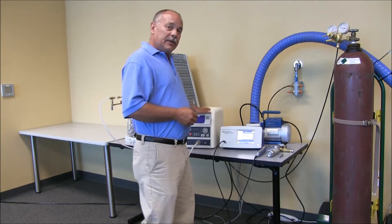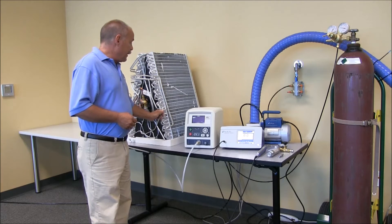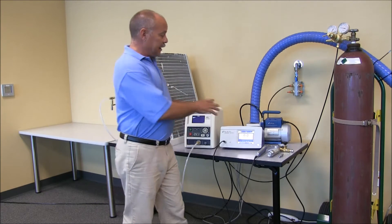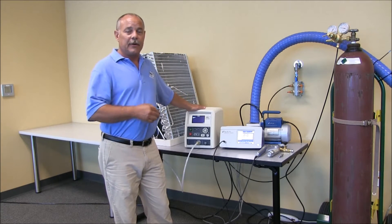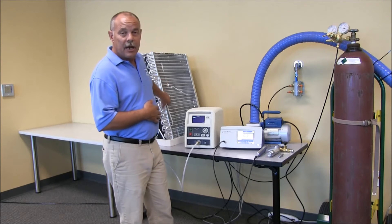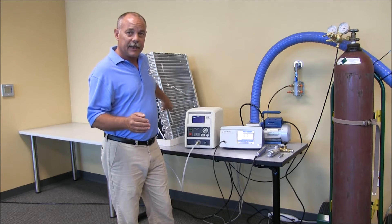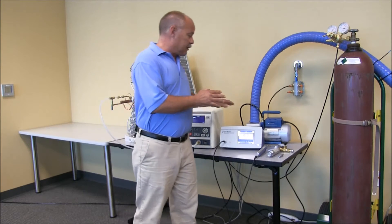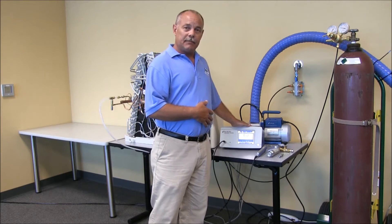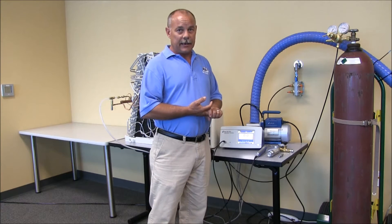Today for this demonstration I've chosen an A-Coil. We are by no means recommending this leak location system to find a tenth-of-an-ounce-per-year leak, which is the typical leak rate specification for this product. This product is typically leak tested upstream with a gross leak test. This system is suitable for anything that can be detected with a vacuum decay, pressure decay, or mass flow technique.